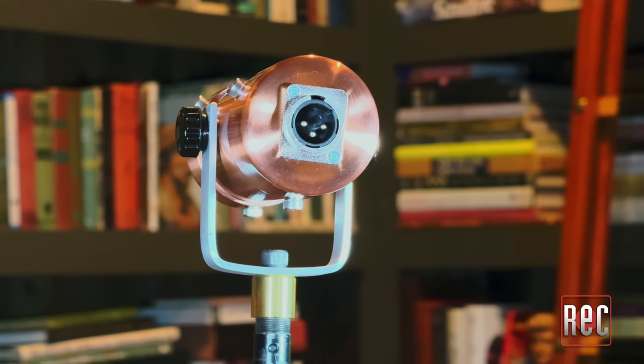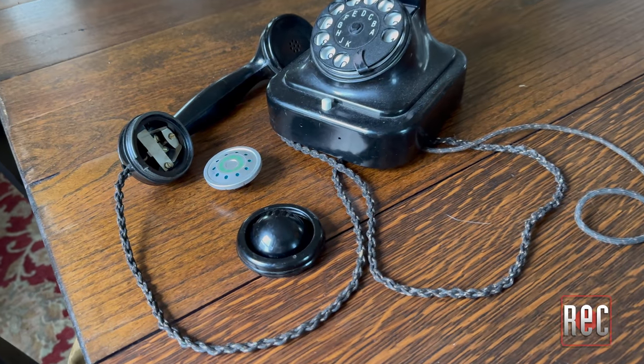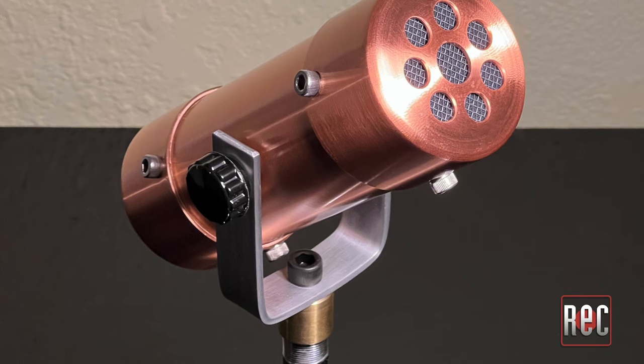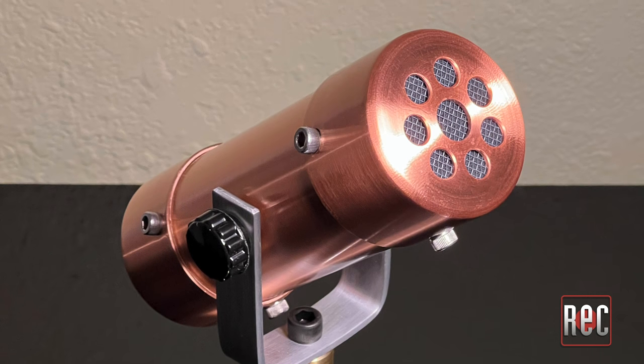While the Copperphone is designed to deliver lo-fi sonics, its nostalgic radio and telephone vibe is achieved differently from many telephone effects mics. Typically, old telephones and many phone-style mics make use of a carbon mic element. The Copperphone, however, is a dynamic microphone. Internally, it uses a rear-vented dynamic mic capsule in a chambered body with mechanical filtering to achieve its tonality. For a more traditional carbon telephone effect sound, make sure you check out one of Placid Audio's various carbon phone offerings.